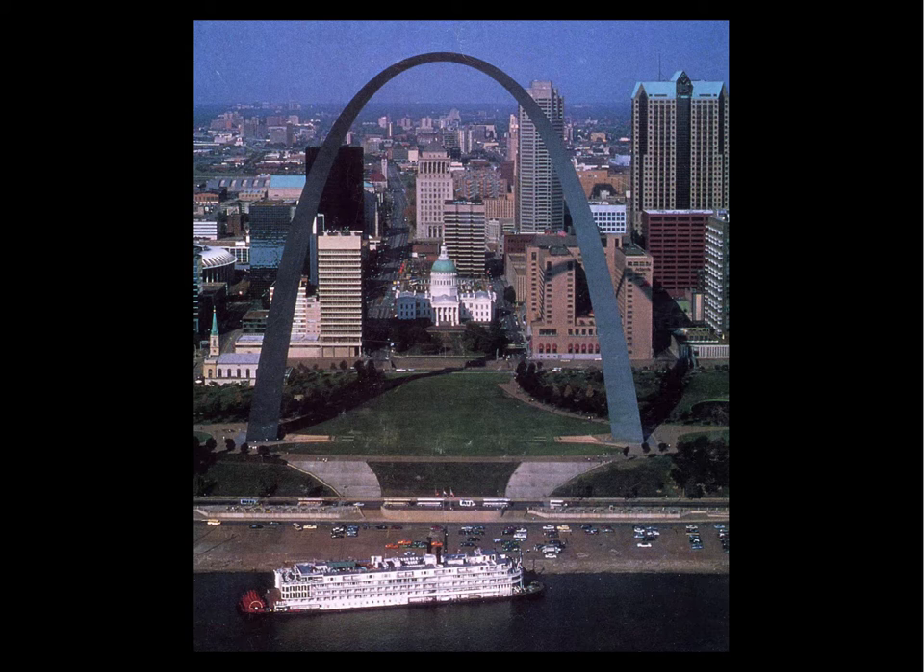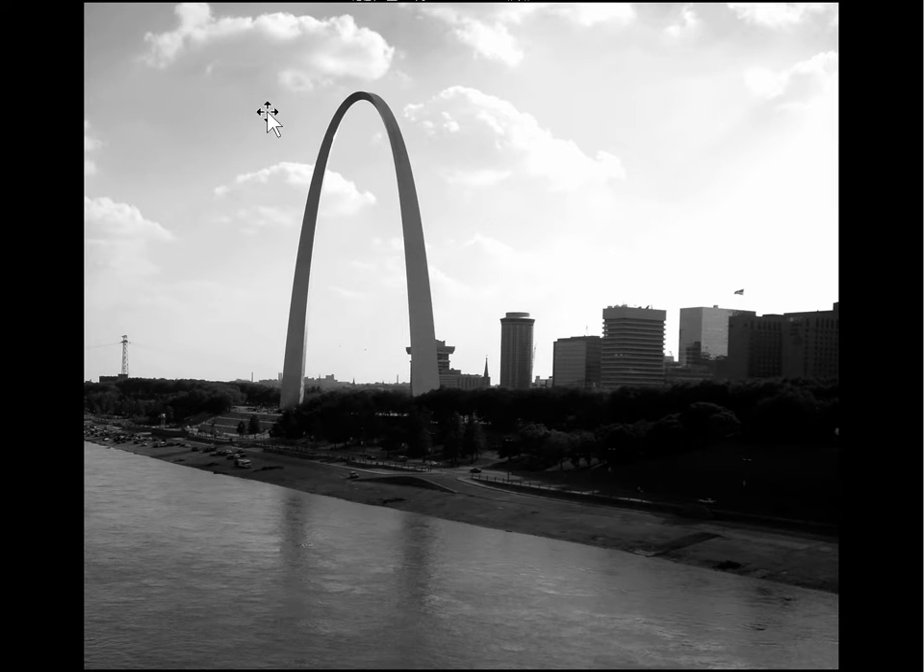This is the St. Louis arch. We're looking straight on to it, but what we're really worried about is motion in and out of the page — the tendency of the arch to move horizontally at the top. That lateral movement is resisted by the thickness of the arch at the base. Under wind load or seismic disturbance, this bending capacity as it comes out of the ground is absolutely crucial.